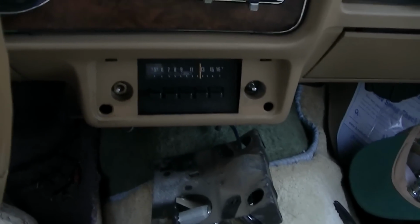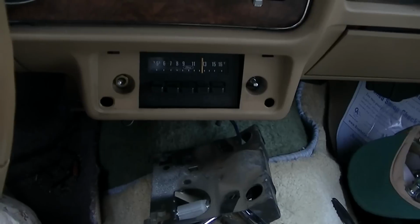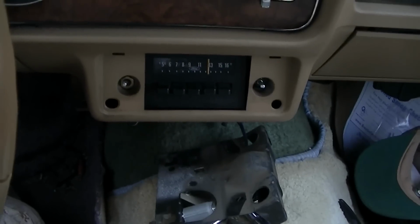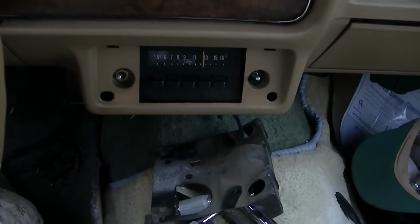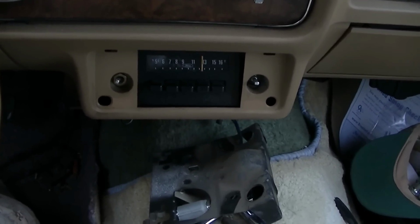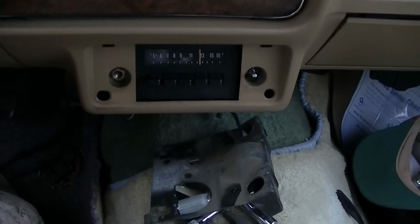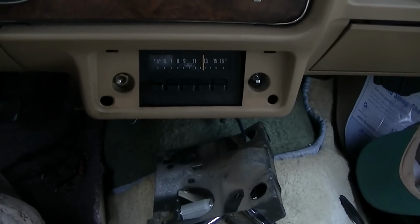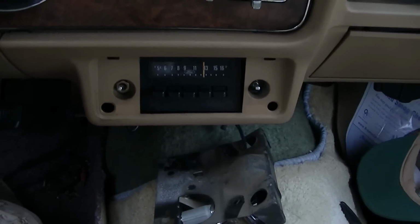You can hear that it's kind of distorted, and it sounds like the AM alignment, the IF alignment's off, like it shifted real hard over to one side. Well, that's because the capacitor I put in there is not connected across the outside of a center-tapped coil. It's just connected between one side of it. So it's like I'm missing half of that right there. It's probably way out of tune. But I've done the best I can. That's about it. Without risking destroying it, I think this is the best route.